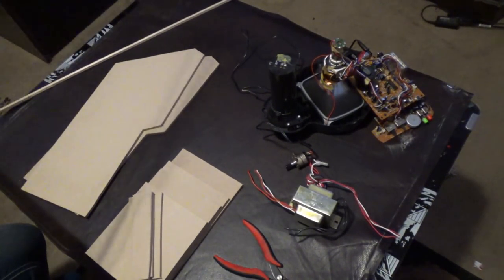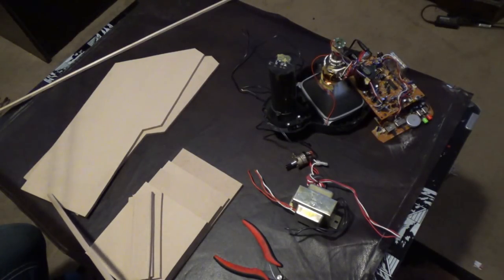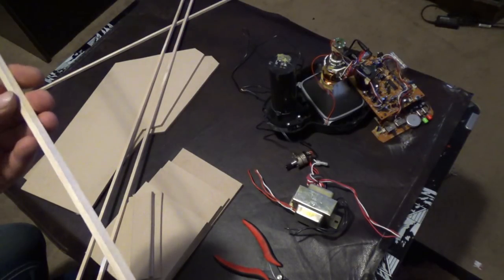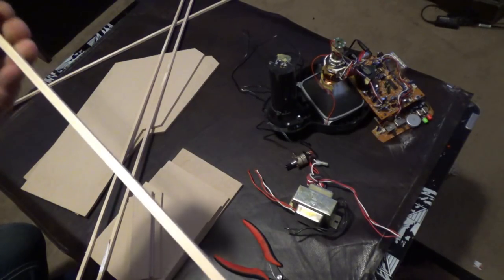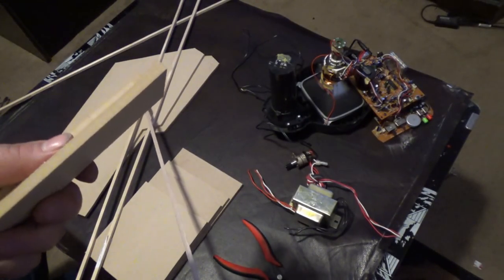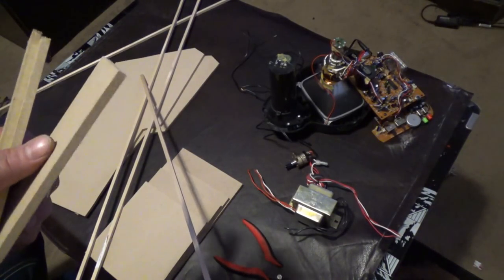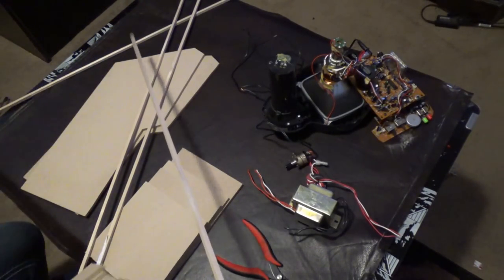This is 1/4 scale. So the top of this cabinet to the bottom of the cabinet was 18 inches. Everything is going to be precisely quarter scale, except for the wood on the side. This wood is a quarter inch, and instead of 0.25 inches, it should be 0.18 inches, but they really don't have a size like that, so it's going to be very close. This is about as close as you're going to be able to get.